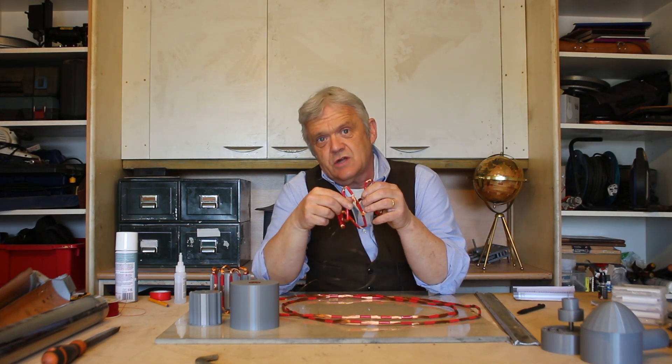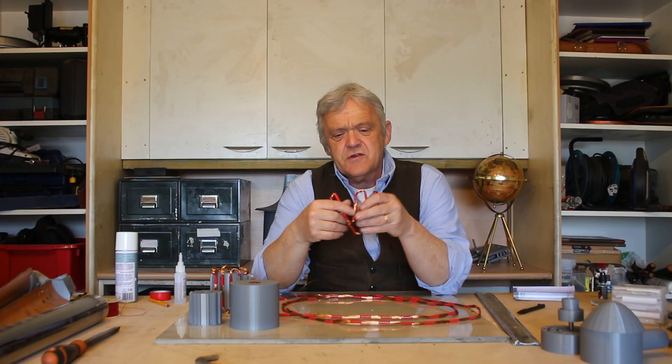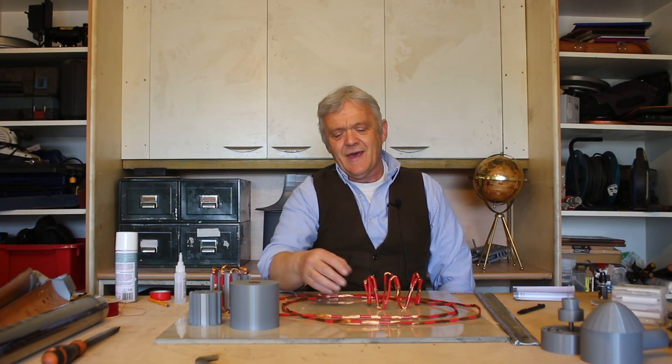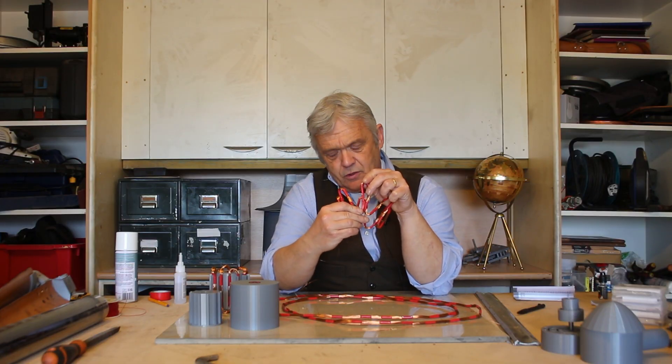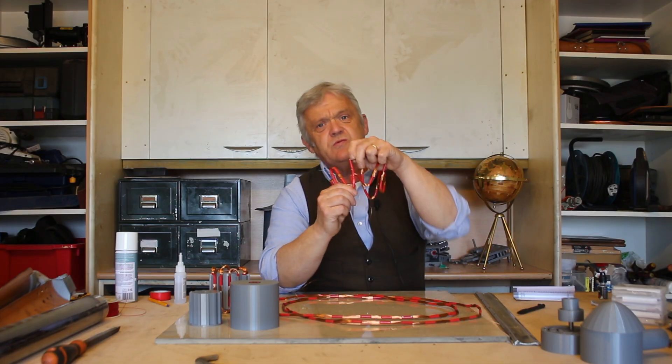By removing either a top or a bottom, we've improved the energy density of the generator we're going to make — or if you like, we've made it more powerful because it's more energy dense. If we can keep these wires in the straight direction, we've made it more efficient because the wires are at the most efficient orientation. The longer the magnetic field, the more of the wire will be straight and the more efficient it's going to be.